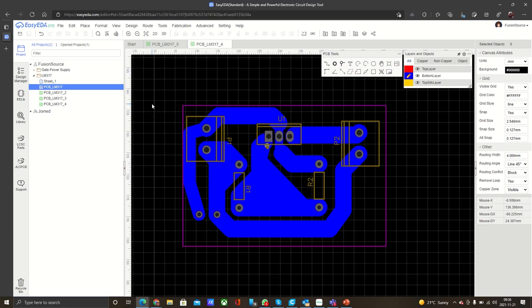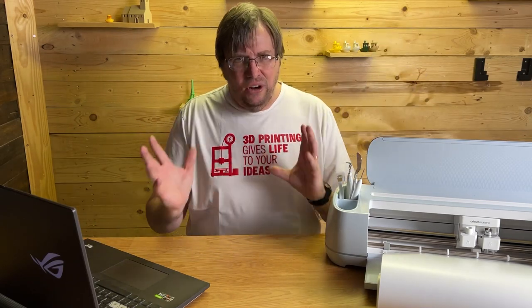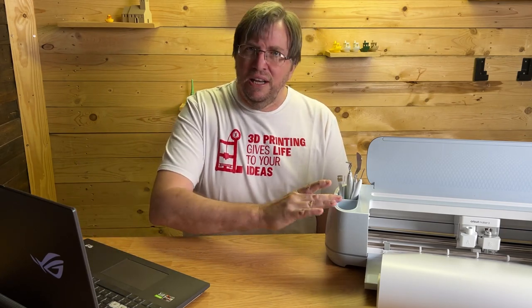What I've used today is something called EasyEDA — you can see it on the screen here. I've created a simple PC board for an LM317 to take 12 volts down to 3.3 volts so I can power my ESP01 board. I made it up on breadboard and it works, but I want to integrate the power supply and split out voltage — 12 and 3.3 volts. I need to experiment first to see if this machine can cut out my PC boards.